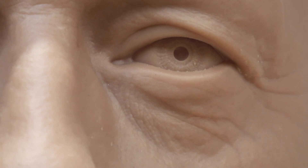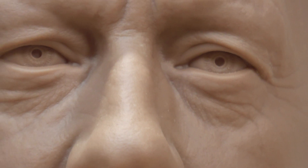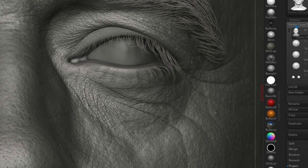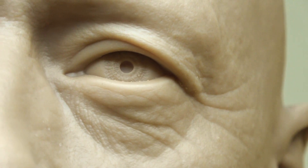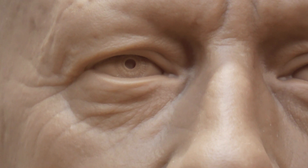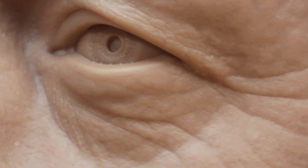The layer lines can barely be seen with the naked eye and can really only be seen on smooth surfaces. This was printed with a layer height of 80 microns. Comparing the print with the original 3D model, you can see the skin textures have been softened a bit, but it's still very, very good. I'd say it's picked up about 90 to 95% of the textures that were in the original scan file. The only thing missing really are the absolute super fine textures.